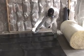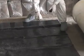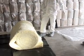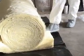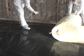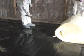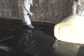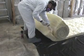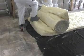Spray the adhesive on the plastic the width of the roll of insulation. Place the roll on the 6-mil, 6 inches in from the side and the bottom. One person sprays as the other rolls out the insulation. You should use about 4 cans of spray adhesive on an entire roll of insulation, making two sections. Cut the roll 6 inches short of the end of the 6-mil.